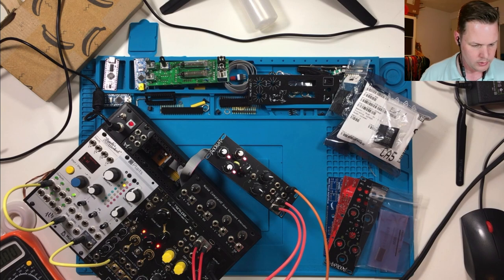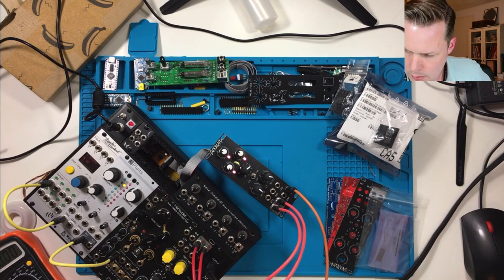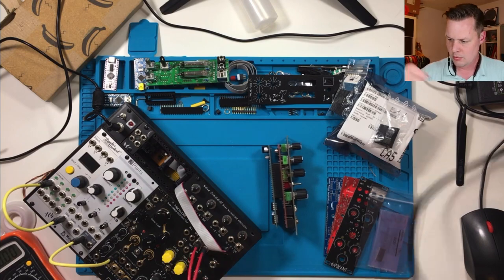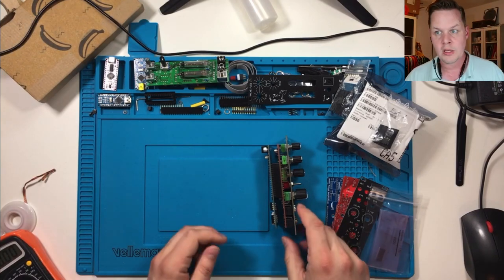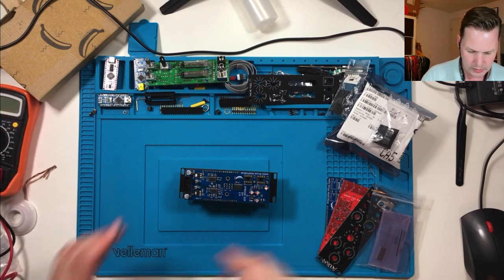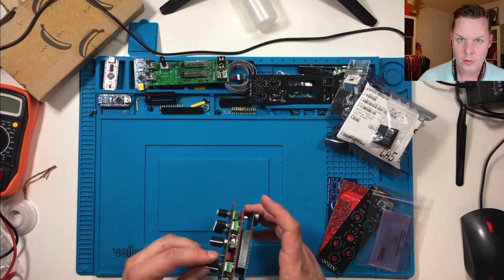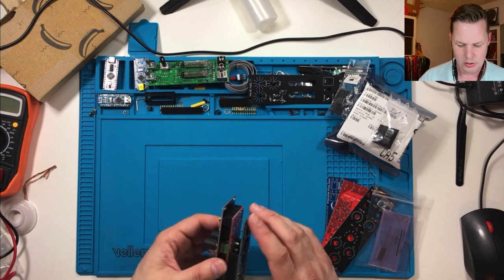I'll stop messing with it now. This isn't all bad. Nice. Quite pleased with this result. So now I know the board is at least somewhat functional. I'll go and clean this up with some IPA and add the two extension ROMs to it, and this one should be good to go.